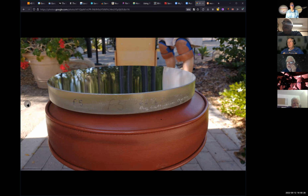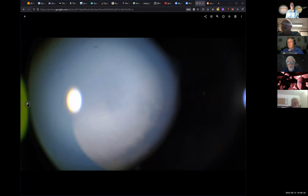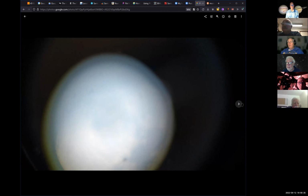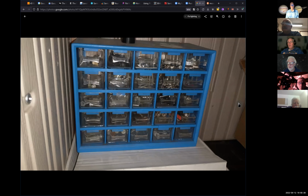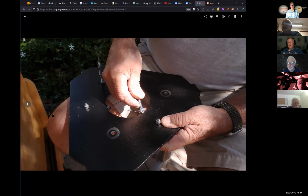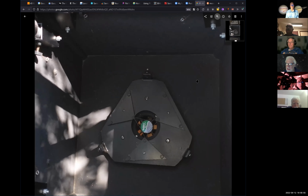The fact that your screws are non-uniform in tension when you're collimating the main mirror by tipping and tilting it indicates that the main mirror support system needs to be shimmed. It's closer to collimation when all the screws have roughly the same tension on them. You don't want to be in a situation where you have one cranked all the way down and the other two partially loose. Now, Jerry, I totally agree with that.